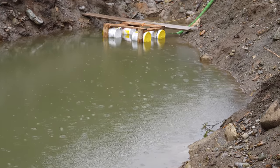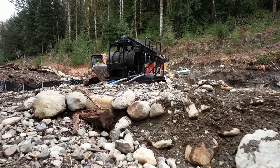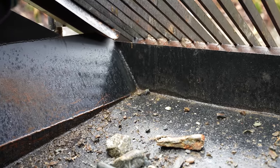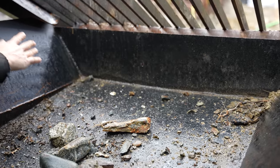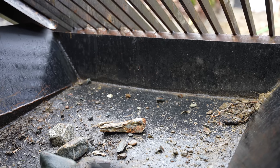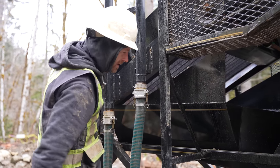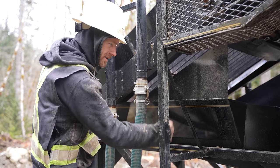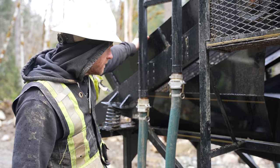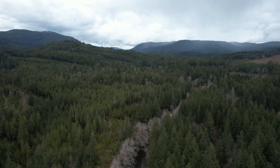We have to make these final fixes to the wash plant. This is too wide and flat at the bottom, and the majority of the water drops through right away, so all of this is sitting full of stuff and not running out. We're going to reline it with more of an angle, and I'm going to cut these grizzlies off — I can't adjust the angle since it's built in. So I'm just going to reline the bottom of this internal hopper, and that should be enough.